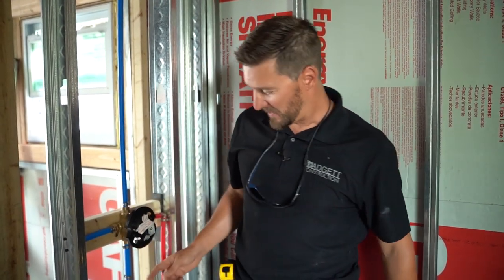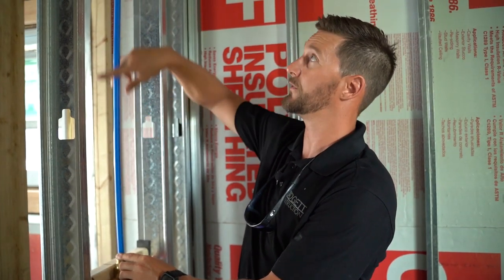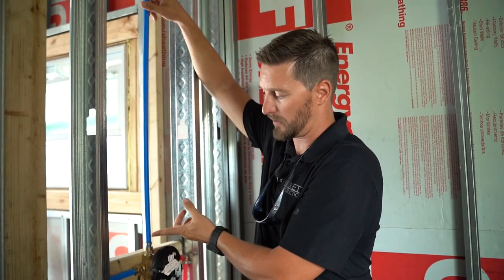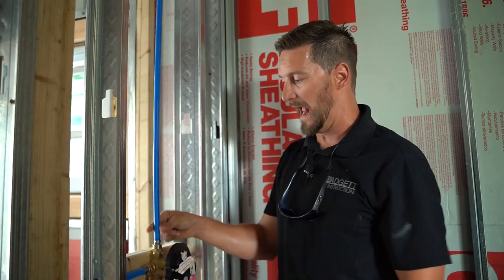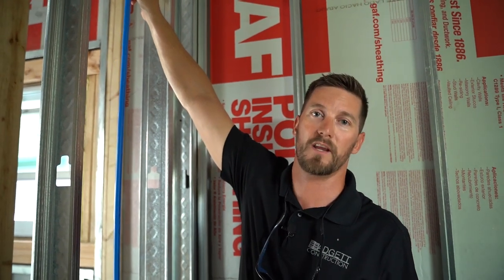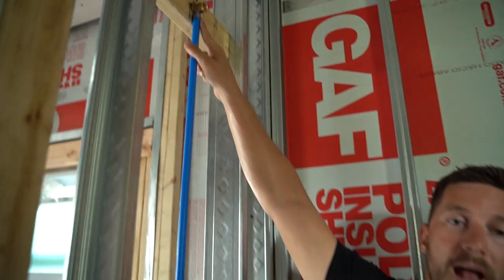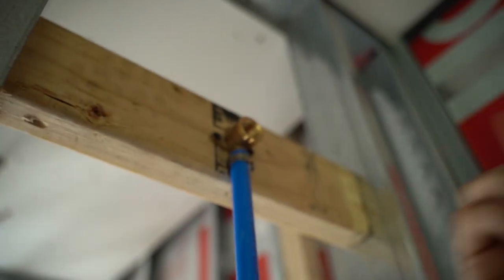We've officially time-warped ahead to our shower valve installed. This is that plug I was talking about installing. You can see we've got our shower spout coming out the top of the valve here. This doesn't need to be blue — it could be blue or red because at the point of coming out of the top of the valve it's going to be mixed to whatever temperature you're using. I just had more blue so I used blue. This is going to run up to our shower head. And then we have a PEX — it's called a dog ear. It's just got two little fins on it that allowed us to screw in our shower head fitting, which is just a half inch female.